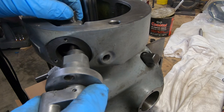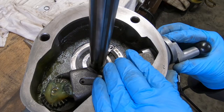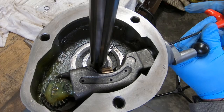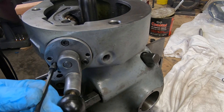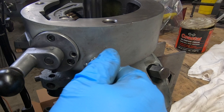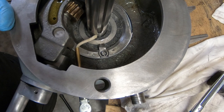Next I'll put in the power feed engagement lever. There's a pin — it's got a hole in it — you have to line up the end of the shaft on this lever just right so it captures it. And since I need to oil my spindle bearings, I needed to get a new oil tube as mine was missing originally. I did notice that the power feed cradle kept hitting the tube, so I used some pliers to put a small bend in it — I think it's still going to hit it but it shouldn't block it.